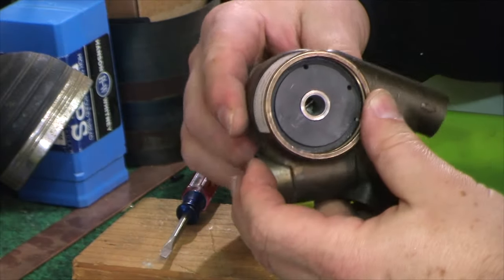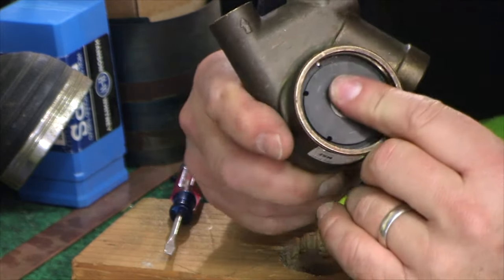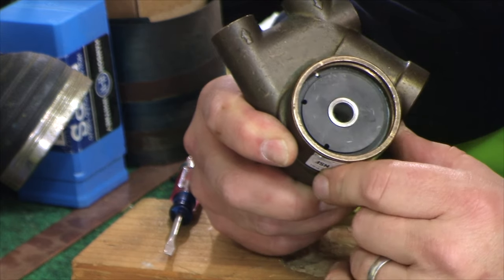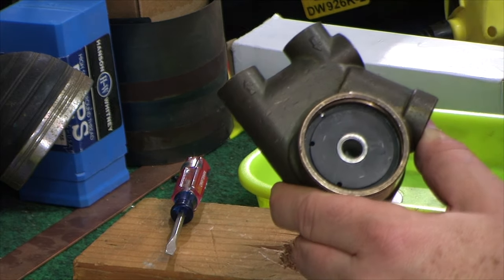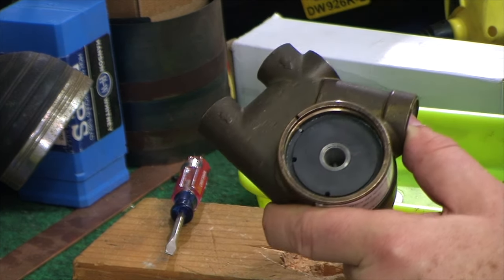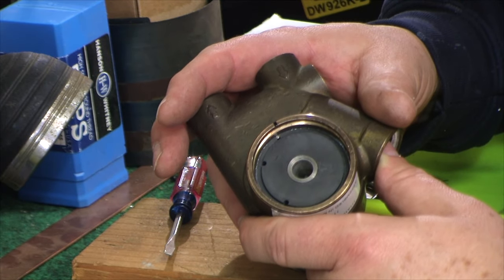As we look inside the pump, one of the most important things is — if you look in the pump right up at the top — you'll see a little stainless steel pin. The orientation of this pin aligns everything up and it's critical that you mark it or get it back into the right slot. I did a little scratch on it, but you could easily put a Sharpie mark.